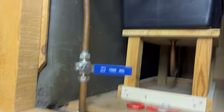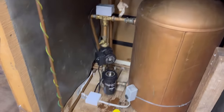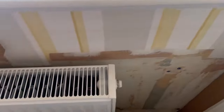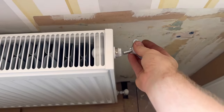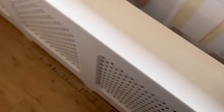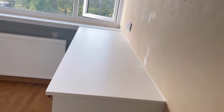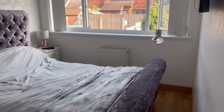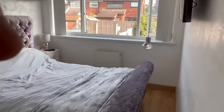Just put a little valve in there - let's drain it down. These weren't working, that's the one we left, so I'm just gonna bleed the rads and get all the water out. Have a look at what the water's looking like as we're going down. There's one in this room, one in that room - this one we fitted as well. They've got two existing ones, one in the bathroom and one in the bedroom. The water is not looking bad at all.